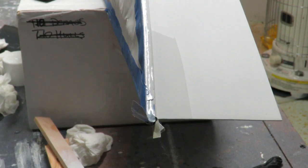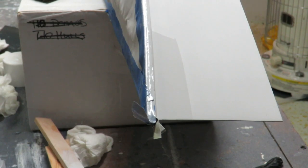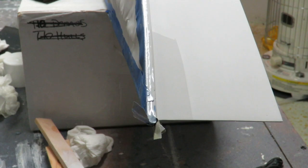And if you got up to 1,000 grit, you'd be working. It'll sand out eventually, but it'll take five times as long. So with each grit, don't skip any areas. Just be meticulous about sanding everything fully to that level of grit, and then move on to the next grit. But it doesn't take very long, just because you're not changing much when you just have a jump of 200